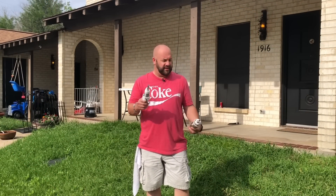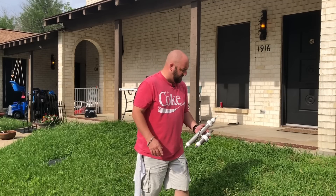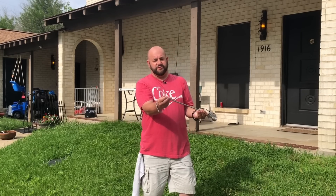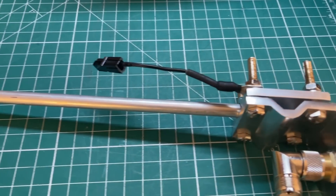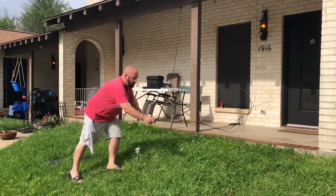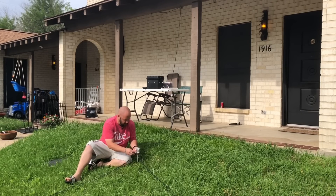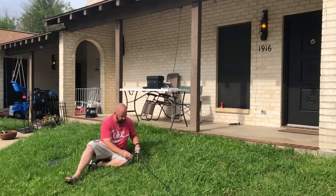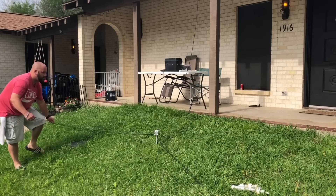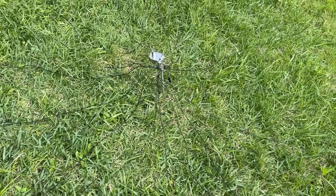While I primarily use the Silver Bullet Mini, I'm going to try to tune up on 80 meters with the Silver Bullet 1000, using the stock whip — I think it's about eight feet. Instead of the tripod legs, I'm using my 'K-Murder Death Spike' — actually just a leg from the mega tripod that I ground to a spike with a mirror mount. I'll attach the counterpoise wires to one of these lugs and spread them out. Now we've got a beautiful radial field.